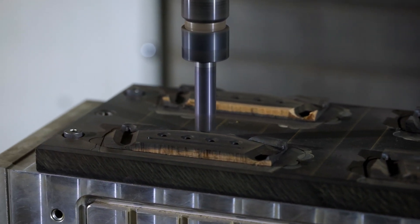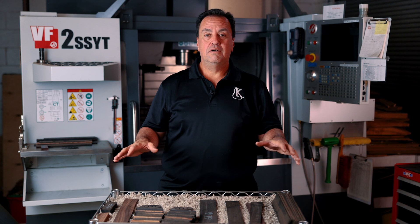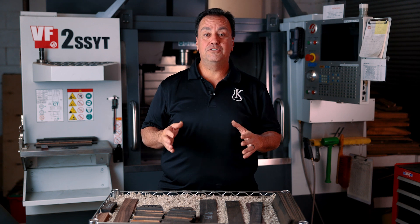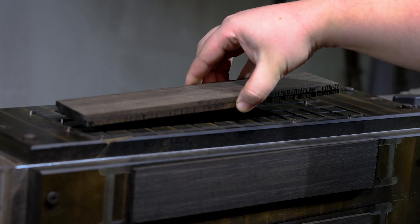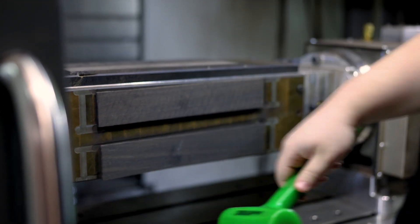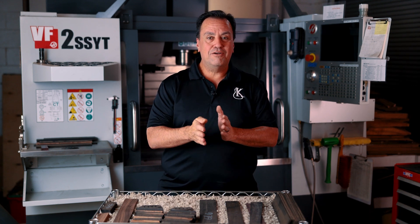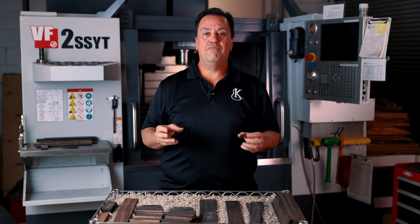Now there are other things we're able to apply while holding the workpiece in place — in this case, atmospheric pressure. Here at sea level, right at Kanilea Ukulele, we're at about 14.7 pounds per square inch of atmospheric pressure. When we look at a fingerboard blank that's two inches wide by 12 inches long, that's 24 square inches, giving us about 350 pounds of atmospheric pressure holding that workpiece in place on the machine. This in turn gives us the accuracy we're looking for so that we can cut, shape, taper and really create that perfect fingerboard.